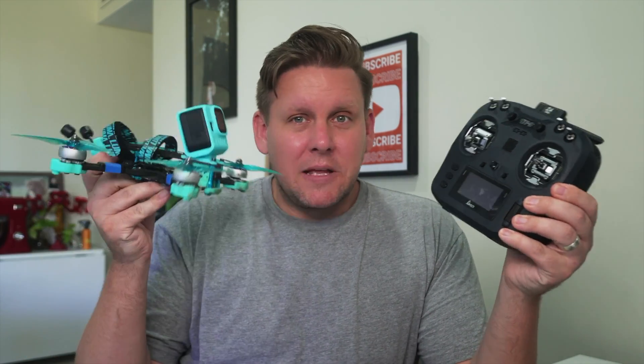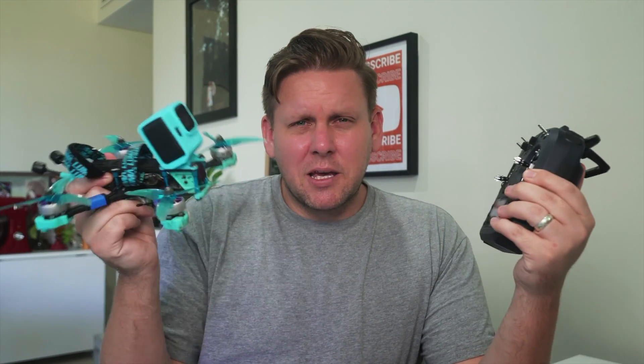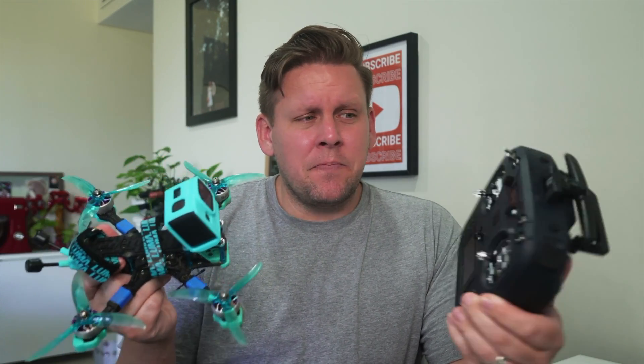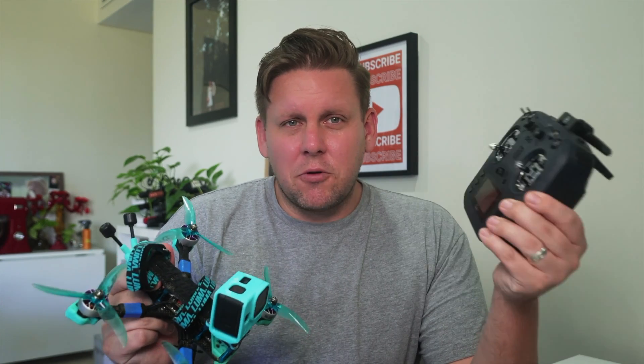When you turn on your radio and power up your quad, everything should work. I'd recommend taking your props off, plugging in a LiPo, and doing a test arm inside your house just to make sure everything reacts correctly. I'd also recommend plugging it into Betaflight and making sure all the channels move correctly when you move the sticks before you get out into the field. If this video has been a great help for you, say thank you by hitting the subscribe button and dropping me a comment. I'm Darren Allett — until next time, don't forget to send it.